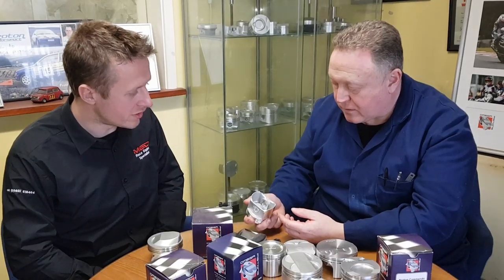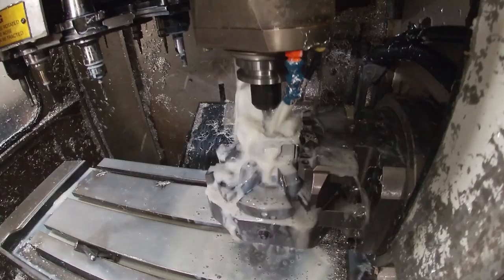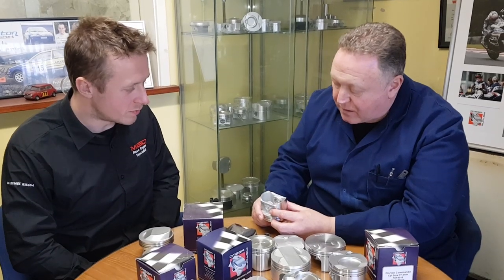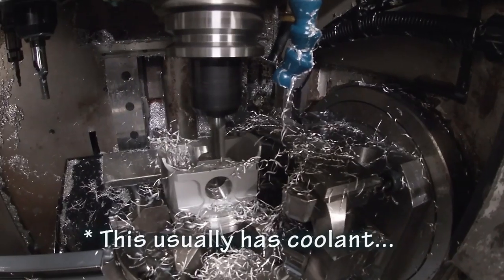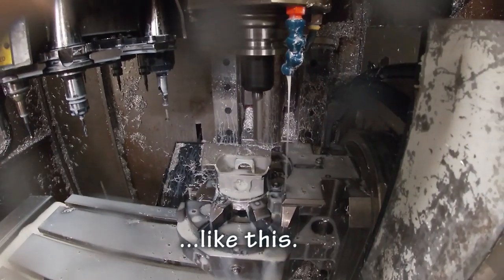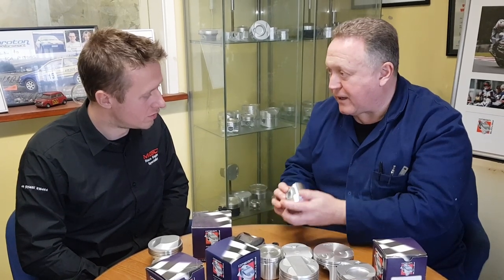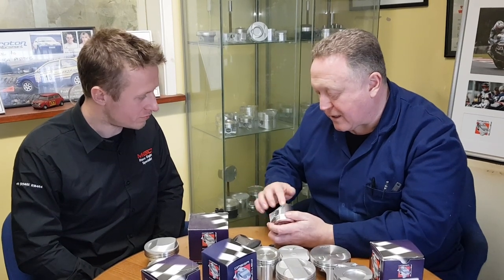So what's happening on the first operation on the CNC? The first operation is the facing of the bosses — that gives it the right clearance on the conrod. There's a different size little end on different conrods. Normally you just have about 1mm clearance. Some pistons are piston-guided conrods and they only have 0.15mm clearance. For this one it's just a nice running clearance to let some oil get up into the hole. If you have it too close you won't get any oil splashed up — on a full skirt piston that can be shrouded.